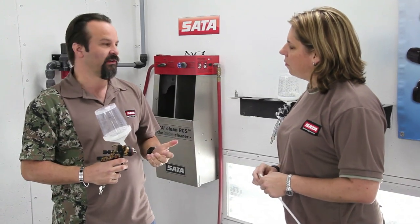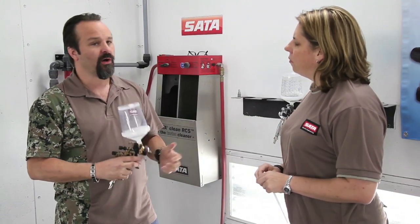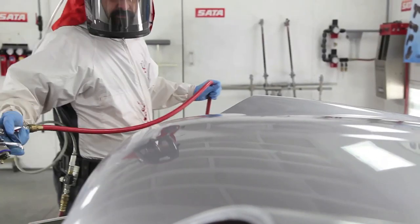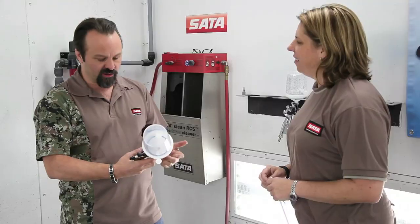What we see many times out in the shops, especially where there may be painting in an open shop or priming with a prep deck — they may just have a prep deck but not necessarily have a regulator there to control pressure. Or you go in the paint booth and all they have is a fitting on the wall, or a regulator that's pinned at 140 pounds.